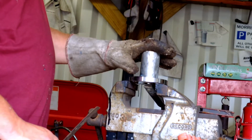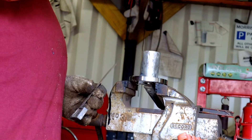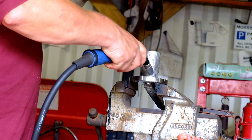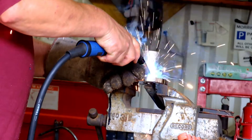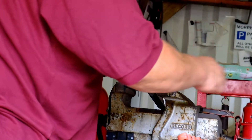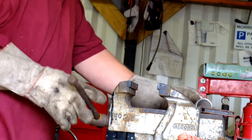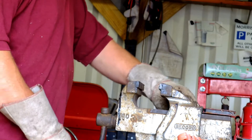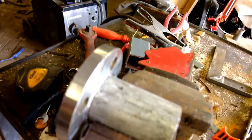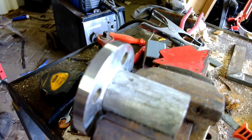Up to this point it's crucial how to get this absolutely square. Take time doing it because once it's up there you don't want to see it lean in. Tack it on. It's tacked on there, just going to run a bead along there now. I find it easier moving the job around.